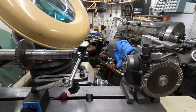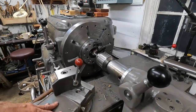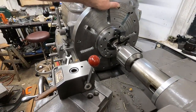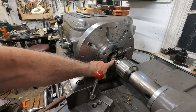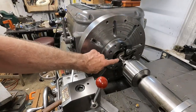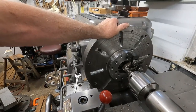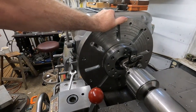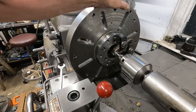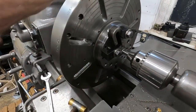Okay, so now this is fun here. I use this Axelson every single day. Okay, this is the first faceplate job. So this is the holder. It's an old forged part, and it needs to be bored out to 5/8, and I'm not going to run a drill bit through it because it's probably a little bit case hardened. So I'll bore it out, and you can see how I fixtured this thing on that plate that I installed.